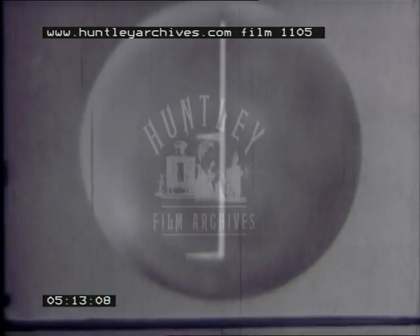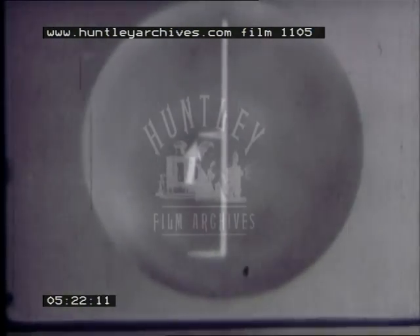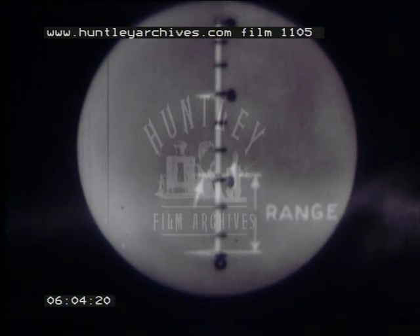So, this is what the spot keeps on doing, and when it does it 500 times a second, it looks like this. Remember, this is the transmitter pulse, and this is the echo — or in service jargon, the blip. But what happens if there is more than one ship? We will get two separate blips on our tube face. The pulses which go out to ship number two have further to go than those to ship number one, so they will come back later, and the blip from ship number two will happen further up the time base. If number two is twice as far away, its blip will happen twice as far up the time base. The distance along the time base from the transmitter pulse to the blip gives us the way of finding the ship's range. We have a scale fixed in front of the tube face, and from the position of the blip on this scale, we can read off the range of the ship.